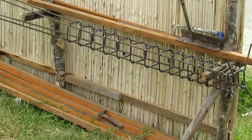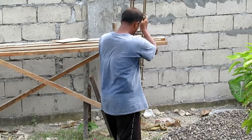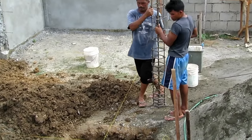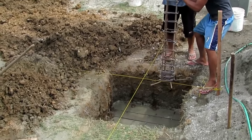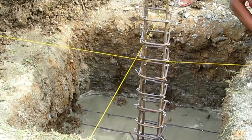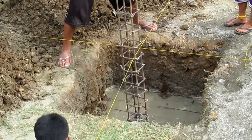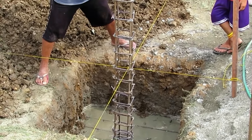There is no shortage of steel that goes into a project like this, and most of it is done in accordance with engineering specs — but as far as I'm concerned it's always better to be safe than sorry. These guys are setting one of two columns inside the compound that will be our main supports. There is almost 80 centimeters of concrete already set in the footing for this post, and the post will be set into the wet concrete with about another 30 centimeters of concrete poured over it. It will be strong.